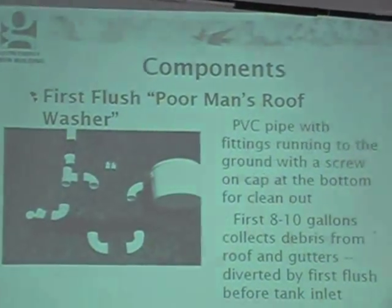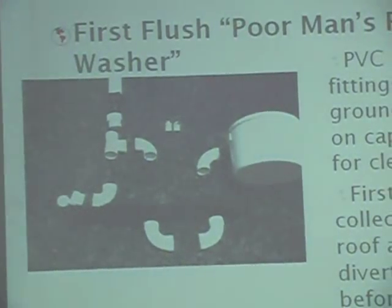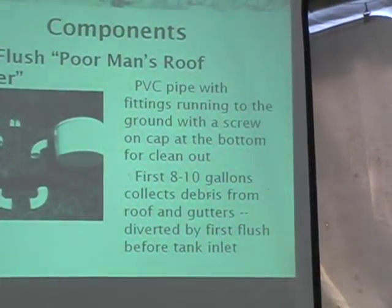The simplest way to get water into the tank makes a very attractive place for kids to chin on or climb on, so if I ever see one of those more than a foot from the house it's usually broken. Instead of going straight into the tank, you can go down — above ground, below ground, underground — as shown by that little line of mulch representing ground level. You can go underground and then back up into the top of the tank. As long as you enter the tank lower than the highest point of the solid PVC piping in the system, the tank will always fill — it works like a P-trap under your sink.